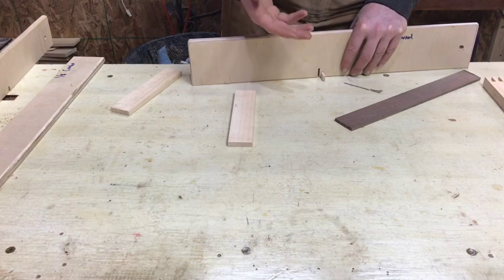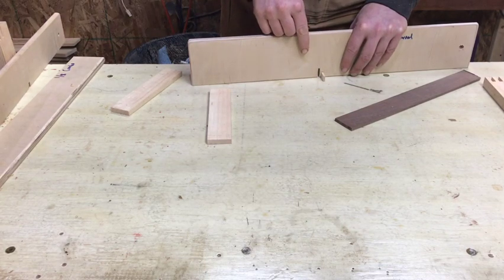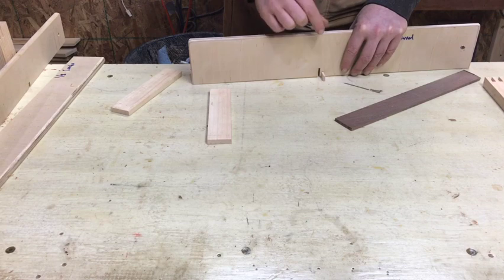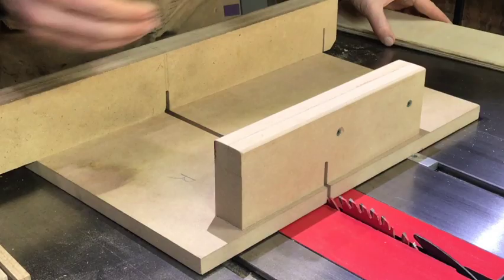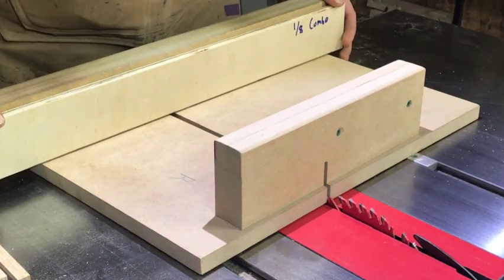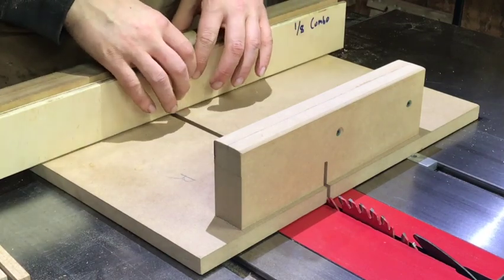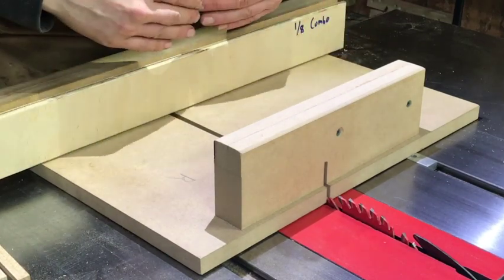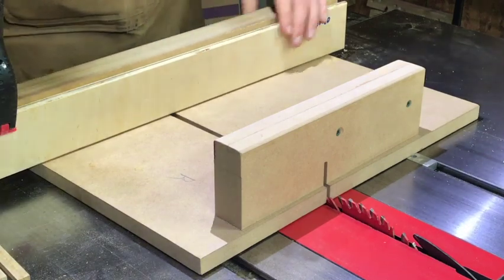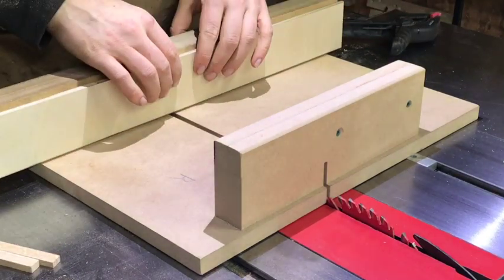For the one I'm rebuilding, I'm doing it for thinner material, so I'm going to make it probably only 3/16ths of an inch. We're going to raise our saw blade to that height, perhaps a hair above, and make our initial cut. To make this first cut, line up the width roughly where you want the spacer. If you're using bowed plywood — as a lot of cheap plywood is — make sure you put the bowed side facing inward, so the convex side faces in. When you clamp it, it will pull the whole thing flat.